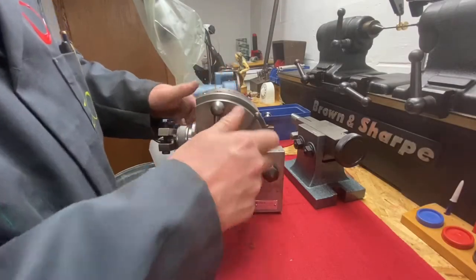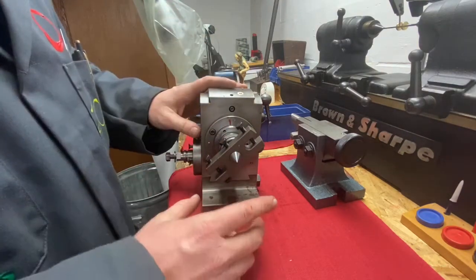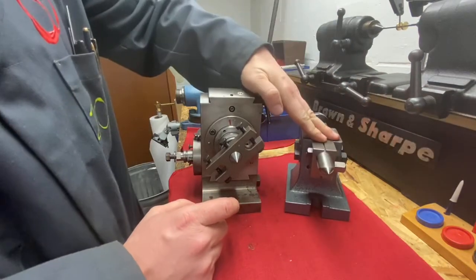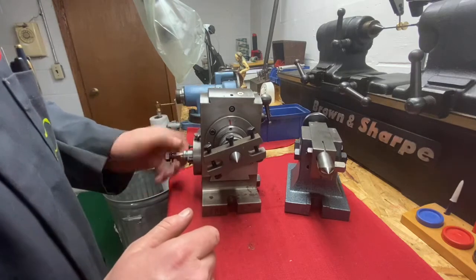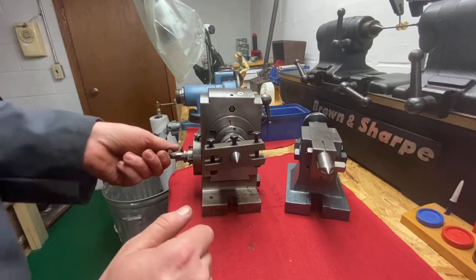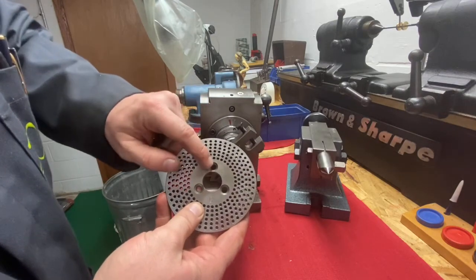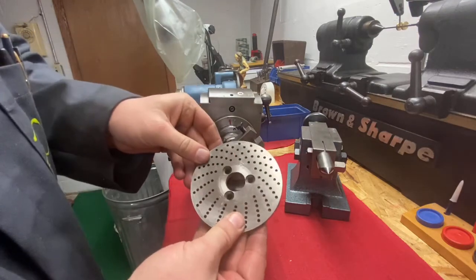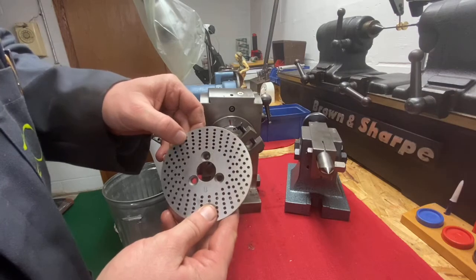This is our second indirect indexer. These indexers are very similar to a lathe in how things are rotated — you can use a chuck or collet, or with this one, you'd actually turn between centers. This would be like your tailstock in your lathe, and this like your headstock. Then you'd turn the screw here to adjust your part around. This one uses different plates with different numbers — this one's got 49, 47, and all these different hole patterns to get different indexes and make different gears. This one actually has three plates that go along with the set, so you can do just about any kind of division you'd like.